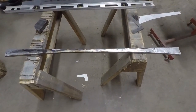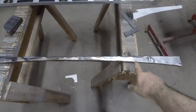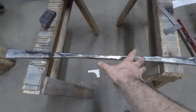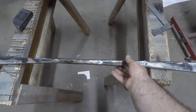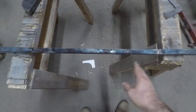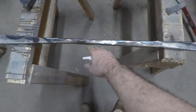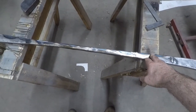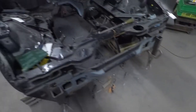The concept was good but it didn't work at all. I welded it through here on the bottom and this part shrunk, so it bowed more. I thought I could just shrink it — made some cuts in here, welded it — but of course it shrunk the other way. Now it touches in the middle but not on the edges. I decided to just cut my losses and came up with another design.